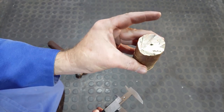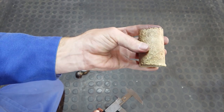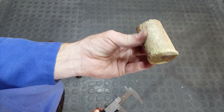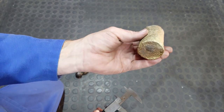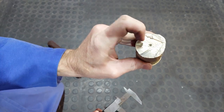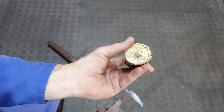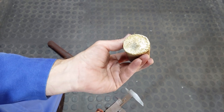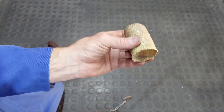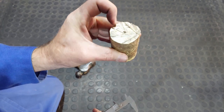This melts at around 1038 degrees Celsius. So it's not as high as copper itself, because aluminium helps it a little to melt as well. And I really love the color of it. In its state now, it almost looks like brass. On some pieces of it, if you look at it with your naked eye instead of through the camera, it almost has a golden color to it. I'm sure if I machine it and polish it up, the whole thing will have a goldish color to it.